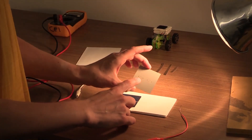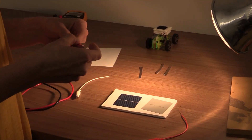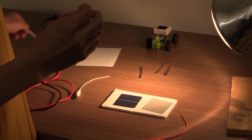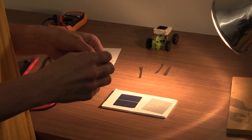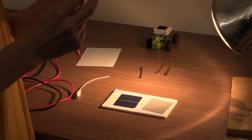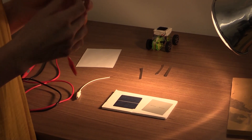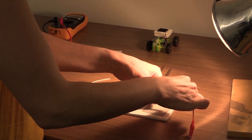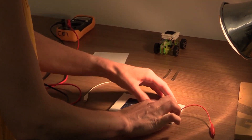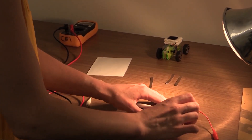On this gray side we have two white contacts — we can attach to either one of those. We're going to peel off the backing on our copper tape and stick that onto the exposed copper wire. This makes it easier to align with the contacts on the solar cell instead of trying to hold the wire and place the copper tape over it at the same time. Now that I'm aligned, I'm going to gently press it down and smooth it out with the back of my thumbnail.